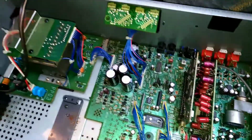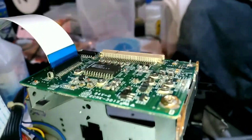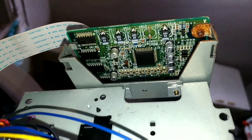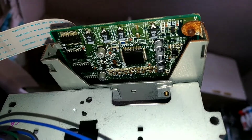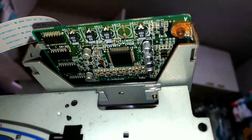The other board is attached to the cassette mechanism, so you have to be careful with it. It's coming off the head — you can see on the bottom the capacitors that I changed, the ones on the right. For the top ones, be careful: if you see 68 microfarad 16 volt, I had trouble finding that, so I had to change them to tantalum ones. Be careful because the polarity is labeled differently — the positive is labeled instead of the negative, which I was accustomed to.